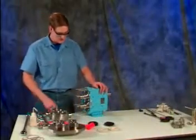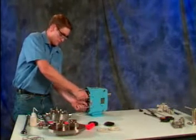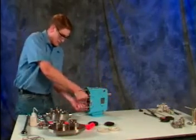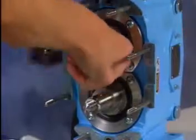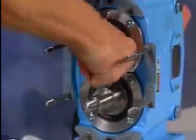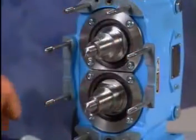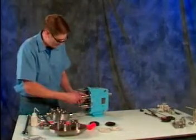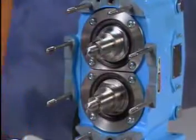If you can feel any free movement when you rotate either shaft without transmitting motion to the other shaft, it's an indication of excessive gear backlash. As the wear on the gears is at 180 degrees, redo the backlash check 2 times at 60-degree intervals. Generally, the cause for excessive backlash is loose or worn gears. Also, check for any axial movement of the shafts, looseness forward and backward.